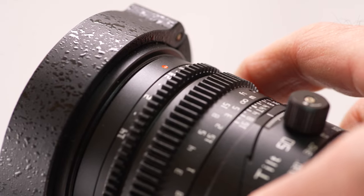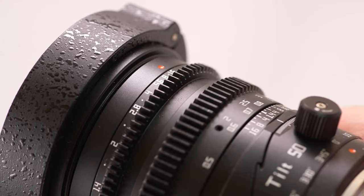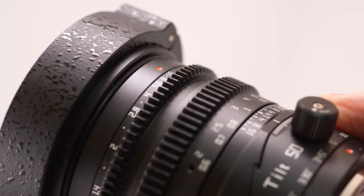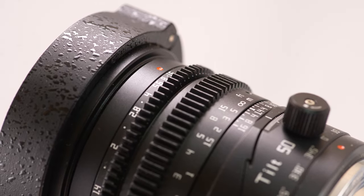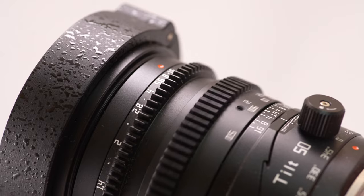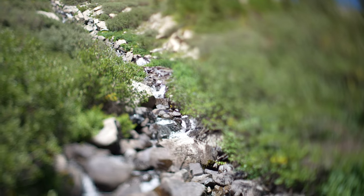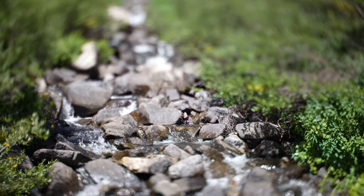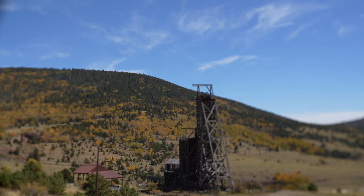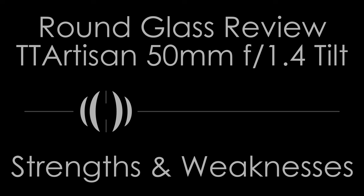The aperture is stepless with a smooth and pleasing aperture ring, aside from the gear milling. The front element is non-rotating but moves in and out 6.5mm, which is 13% of the lens focal length. Focus throw is 210 degrees, including focus slop beyond infinity. The focusing ring is stationary with a milled focus gear interface. Focus damping is highly pleasing, with very smooth response for both rings. Focusing ring play is exactly zero and the mechanism responds immediately. The focusing and aperture mechanisms make no noise, allowing for on-camera audio use if needed.